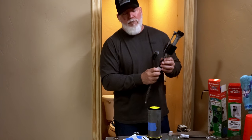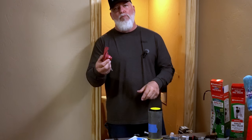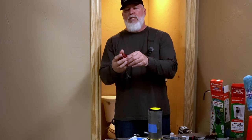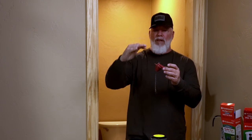If that's not your problem and you don't see water going over the top, the next area to look at is the flapper on a traditional system. These flappers are very pliable when new, but over time with water exposure they get very hard and damaged. Black buildup forms on them and they no longer hold that seal, letting little bits of water drip by into the bowl constantly. All you do is unclip the chain, pull the flapper off the clip bar, and put the new one in. Some flappers have dials that change how quickly the flapper closes.